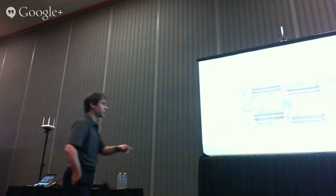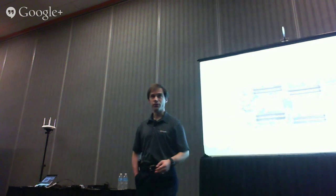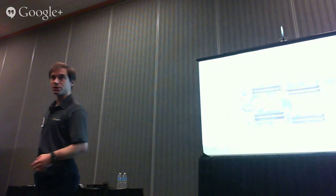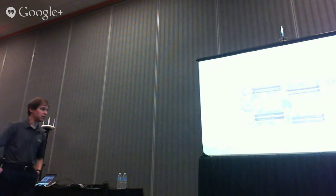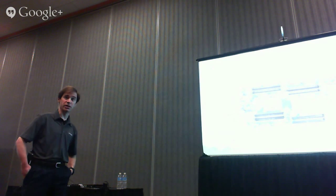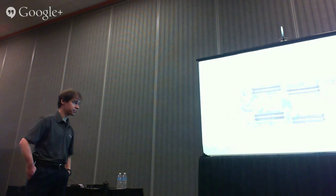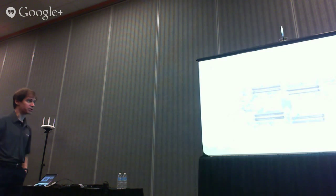And you'll find up here on the left, these 2 connectors are where the SAS cable would connect to from an HBA in the PCI Express spot. On the right, we have 4 M.2 risers. One of them also doubles up as a PCI Express connector, so it's an x8 or 2x4s. When you have all 4 M.2 risers, the far left one on the right does interfere with one of the disk drives. We go down to 3 disk drives if we need M.2.